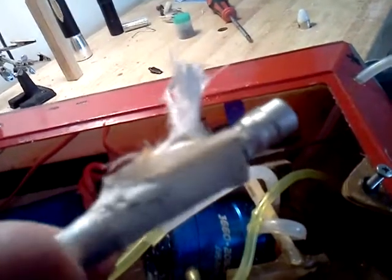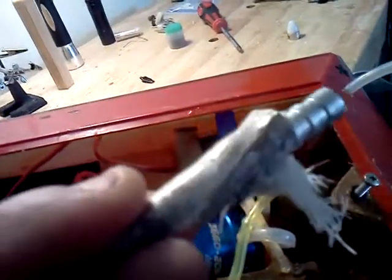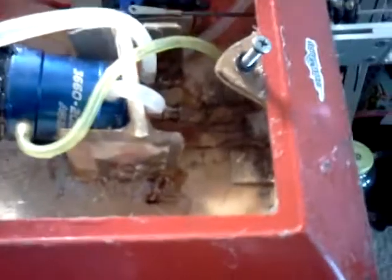So that's what I'll be doing next with the new stinger, and the prop should be a lot straighter. I don't think it's still going to be perfect, being I didn't really have anything to go off of after I removed the stinger, but either way, it looks a lot straighter when it comes to actually meeting the back of the boat there, so it should handle a lot better.